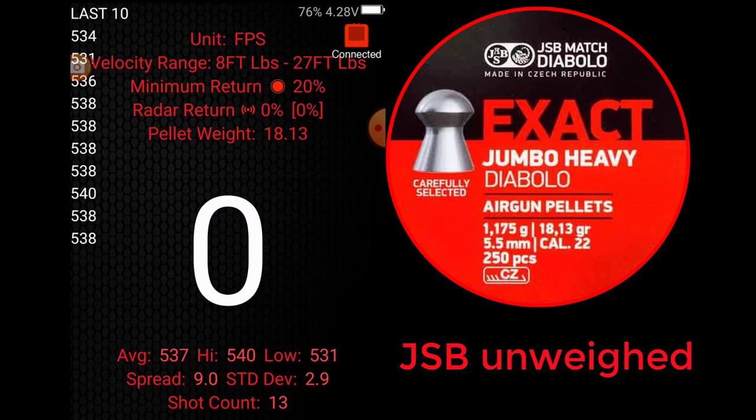And that is low down the shot count, we're down to about 100 bar now, so it shouldn't go higher than that. What I might do is top it up and see what it is at the top end, because we might find that the higher up once the cylinder's full, the actual velocity will be lower because it's harder for the hammer to knock the valve open. So we'll see there. If we find it's pretty low at the top end, that's when I can fit a regulator. I've got two that I can fit, an Altaros and a Robert Lane. So I'll probably try the Robert Lane actually. But yeah, pretty pleased with that.